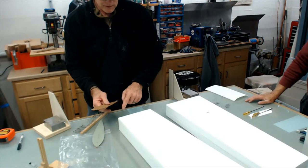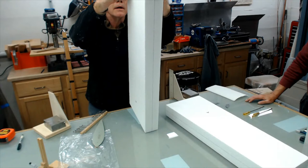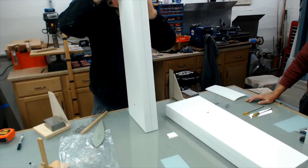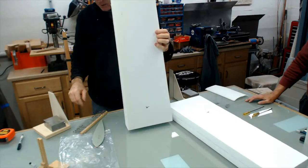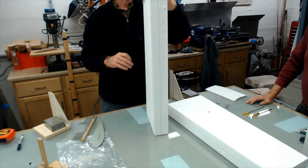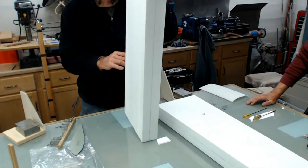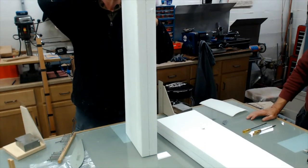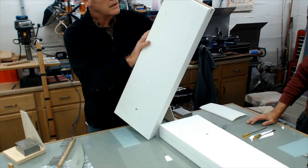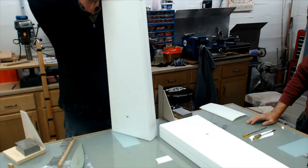All right, trailing edge. I install this template by siding the center line of the template. When I get done cutting this wing, I'm going to go over some of the little intricacies of these templates. One of the things I noticed with John's templates, like I did, he scribed the lines into the phenolic or formica, in my case. If you draw the line with a marker or pen, or you actually mark it with ink, it can wear away. Once you scribe the line, it's there forever.